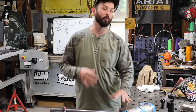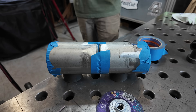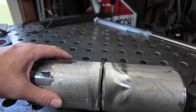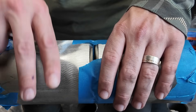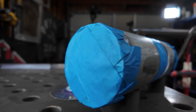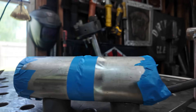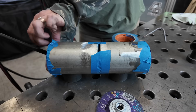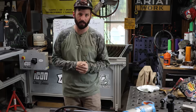Now it's time to tack our pipe. We've got a piece of 3-inch Schedule 40. It's already prepped, ready to go, and I've already got it taped up, sitting on a trough for the right alignment. I've got about a 5/32nd gap. I have tape on this end completely covered and a hose ran on the inside. Sometimes I take that hose and get some pressure off it because it can pull out with just cheap tape. You do not need crazy expensive tape or purging equipment — all we need to do is block the gas.